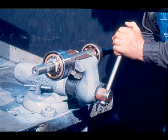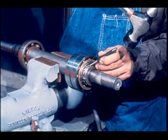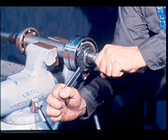Clamp the shaft in a vice, like this. It is often wise to use a vice with protective jaws to prevent damage to the shaft. Now unlock the lock washer from the lock nut by bending this tab back out of the slot. Then remove both the lock nut and lock washer from the shaft and inspect them carefully. In many cases, they should be replaced along with the bearings, since they're subject to damage from a number of sources.